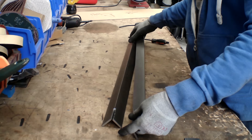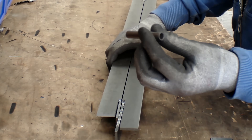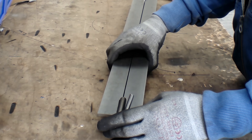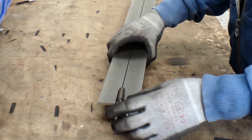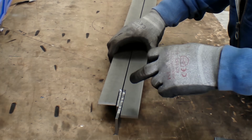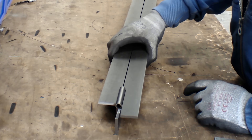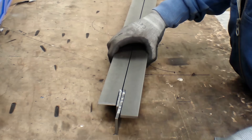The idea here is that these two marry up like so. I'll cut this tube into four equal pieces, stick that in there, and I've got some straight bar that will go through — I'll probably weld it to the last one. The centre of this 12mm diameter hole — I've taken 6mm off each side so the centre line sits right in line with the fold line, which is great. So I've just got to cut that into four, cut it to the right length, and cut two pins. Easy enough.